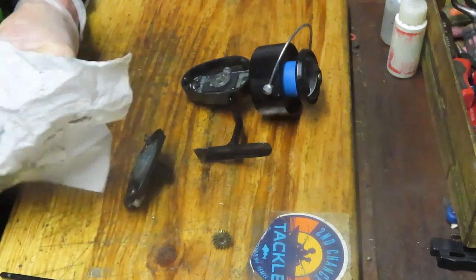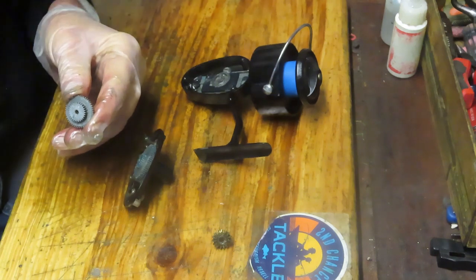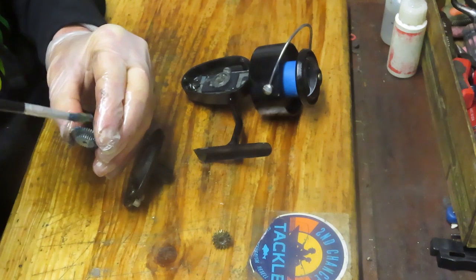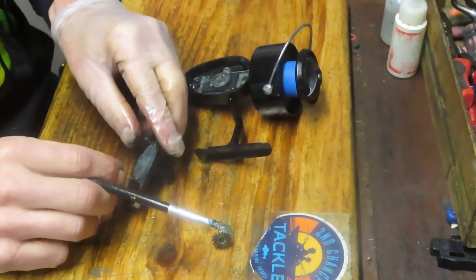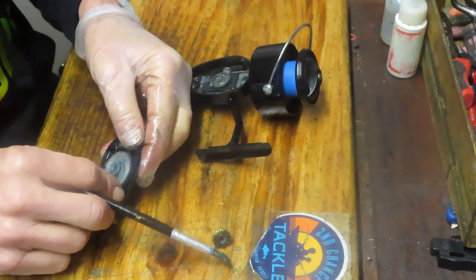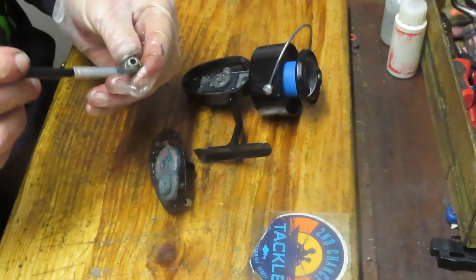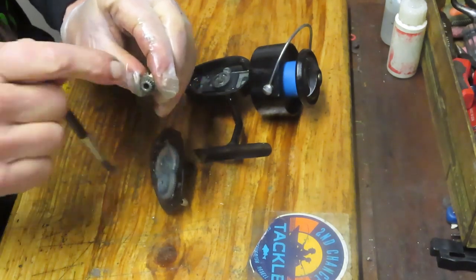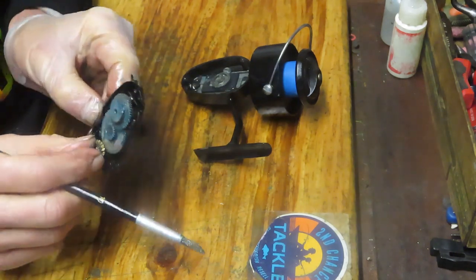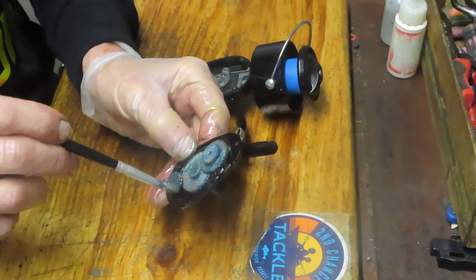Next is the gear that's going to transfer the main gear to the oscillation gear — same idea, check the teeth. That one sits this way and intersects with the smaller gear on the main gear. Remember you had that little washer underneath this one. This is going to drive the rotor. A little bit of grease on the outside. That's how you set the inner case up.